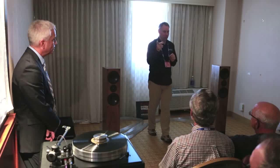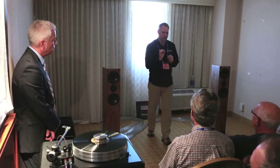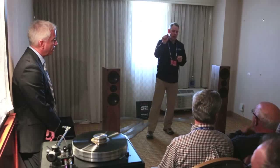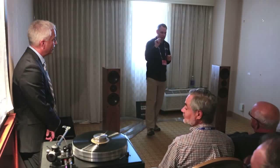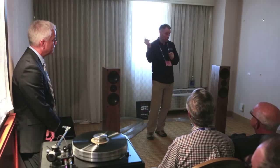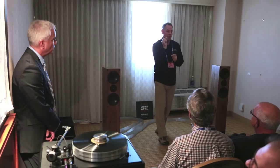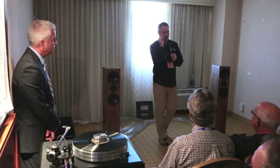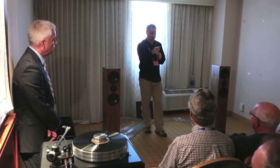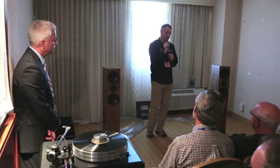You're absolutely right, I also have a Triplanar. You can do it, but it's a little bit sloppy, just a shade. The gradients aren't fine enough on it. On that mechanism, we're going plus or minus 5 notches. There are 100 notches round the knob, so we're moving it 1/20th of a revolution. That's 1/20th of a thread, and it's a very, very fine thread, as you just pointed out. So we are moving the arm height by an almost infinitesimally small amount.